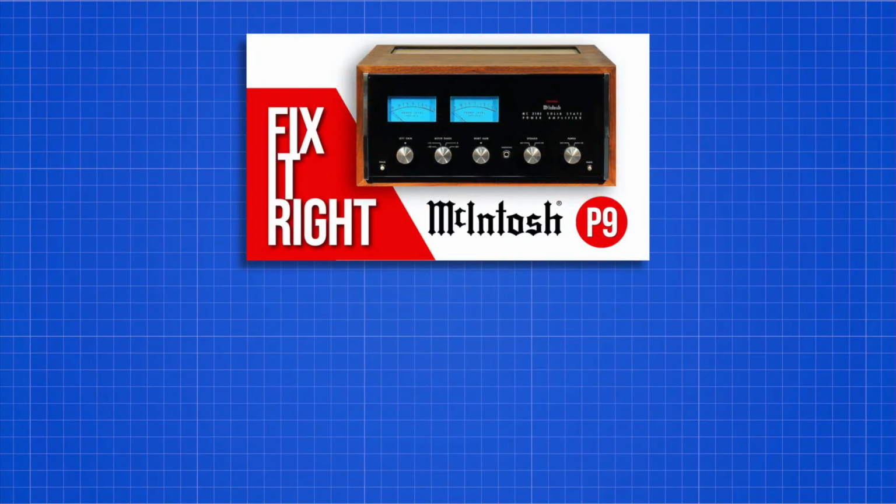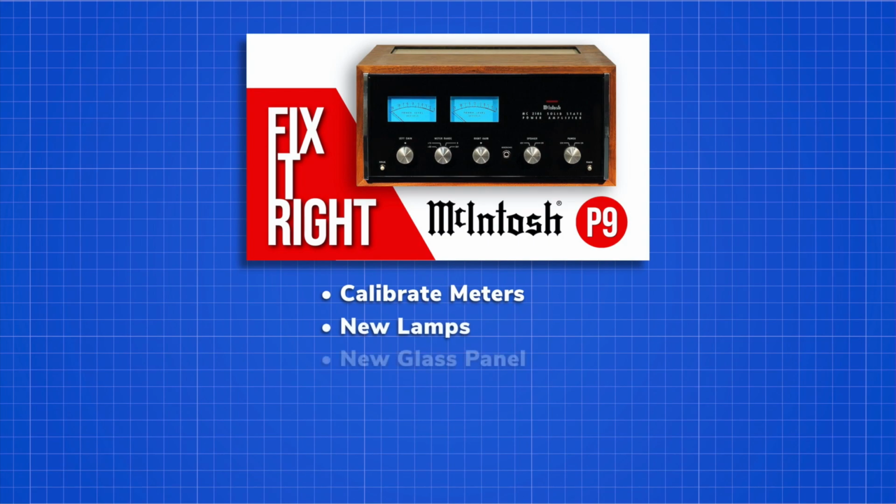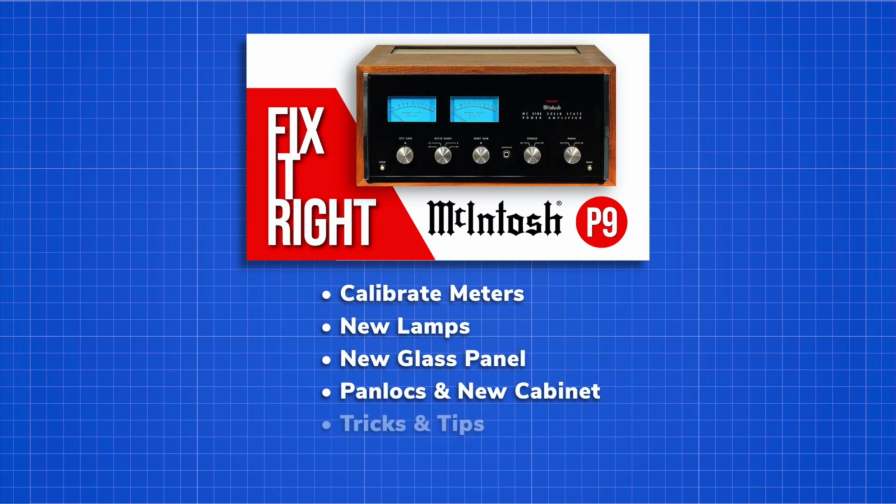In this episode, we're going to calibrate the front panel meters, install new lamps, a new glass panel, and Panlocs into a new wood cabinet. Along the way, I'll show you a trick to get more brightness from the meter illumination, a trick on how to deal with static affecting the meters, and the proper way to work with the delicate McIntosh glass panels without damaging them. Stay tuned to the end to see a demo of the amplifier playing through some vintage 60s speakers.